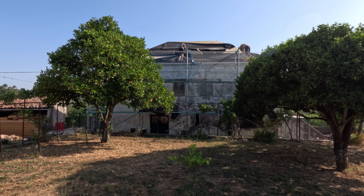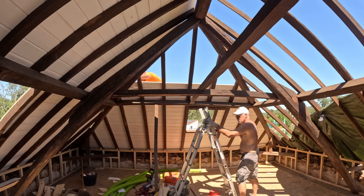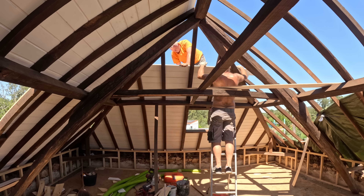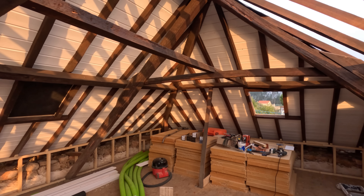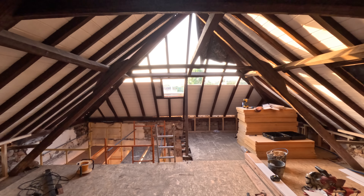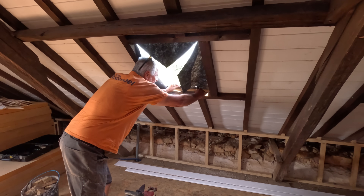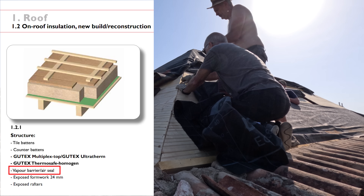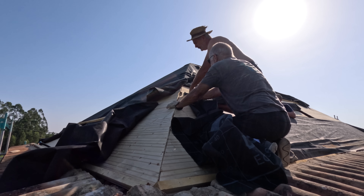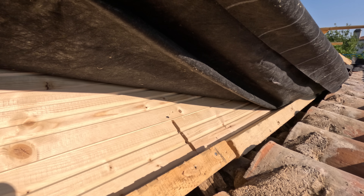Because we've got lots of layers to talk through and many are now covering each other, a quick voiceover is the best way to demonstrate and explain everything. We've installed tongue and groove ceiling boards on top of the original rafters — this is the visible finish from the inside, the dark timber with a nice contrasting white ceiling. This means we don't want to cover it up by insulating under or between the rafters, so instead we're adding all the insulation above. All the layers of this roof design are taken directly from the Gutex installation manual, option 1.2.1. On top of the TNG we've got a membrane — typically used as a waterproofing layer below tiles, but here we're using it as a vapour barrier and air seal to prevent wind, dust, bugs, or anything else from entering the loft space from outside.